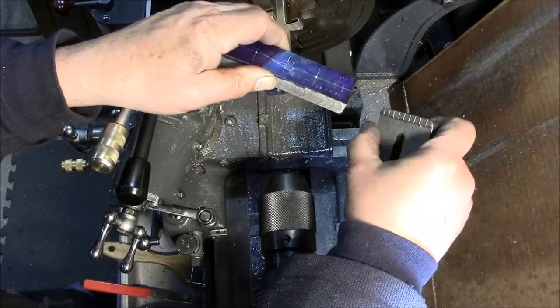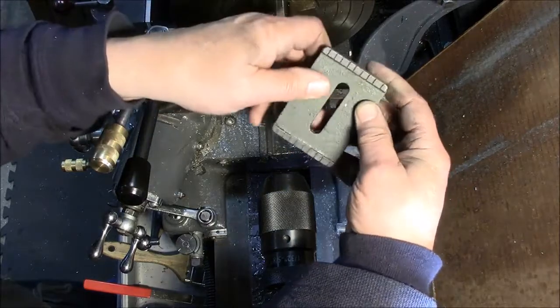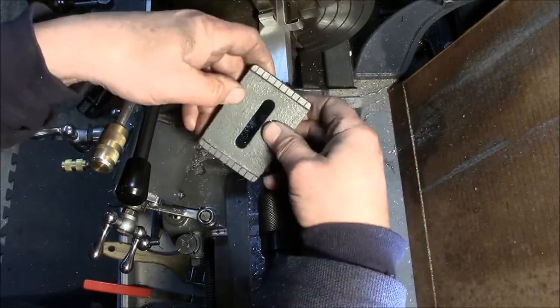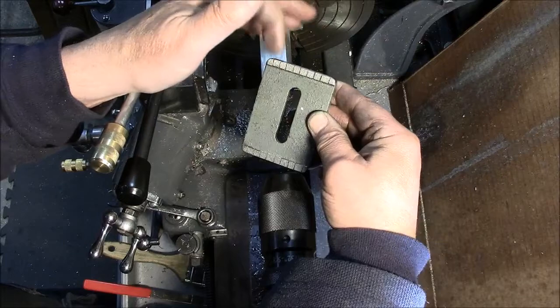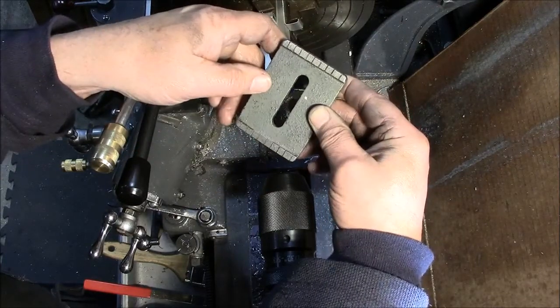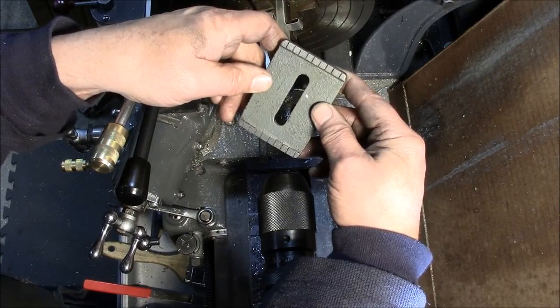So what I did initially is I said, let me take the plate off the bottom of the tail stock. So I did that. And I went and I took a three-cornered file, and I just filed a dozen slots on each side, put it back on and tried it, and it helped significantly, but I still had to put too much torque on.